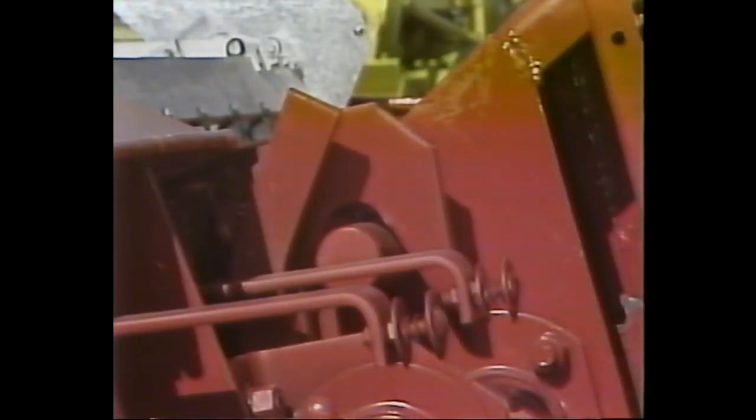Now, slowly drive the combine toward the rear of the head, with the elevator pins lower than the table hooks on the head. When the pins are positioned under the head, slowly raise the head so the pins and hooks engage. Continue to raise the head until it is clear of the ground. Then lower the head until it touches the ground and the elevator pins are clear of the hooks. Now slowly raise the elevator until the pins just make contact with the hooks. If the head is level, both pins will make contact at the same time.